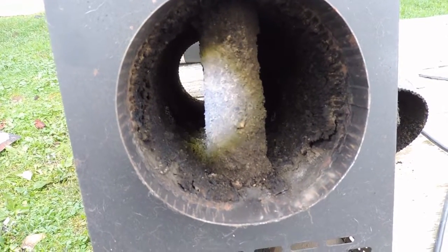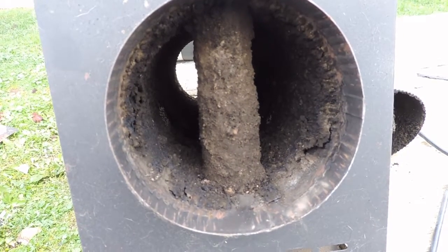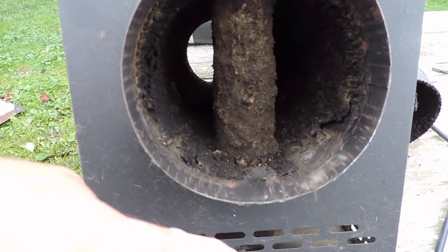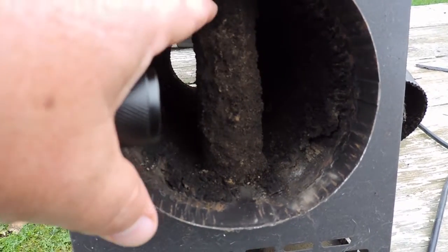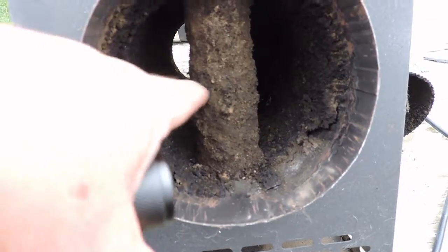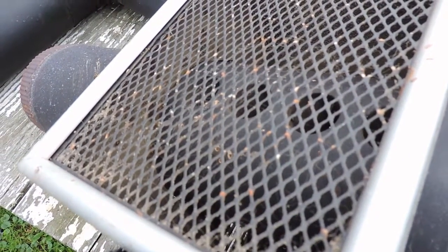And as I said, the way this works is the hot exhaust coming from the stove is coming up through this way, and as it does, the fan is blowing. There are a series of three pipes here that come through the middle of this, and the fan is blowing the cooler room air through those, and they absorb some of the heat of the hot gases coming up through, and then what comes out of the front here is warmer air to enhance the temperature in the room.